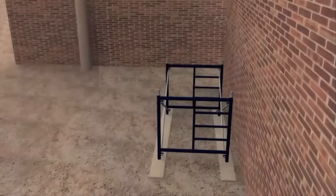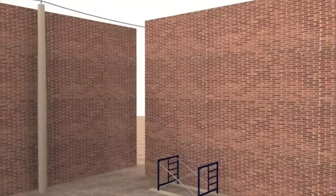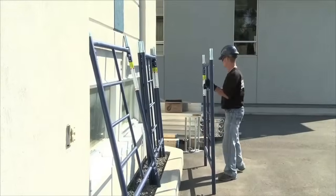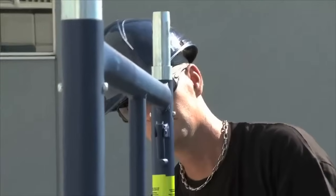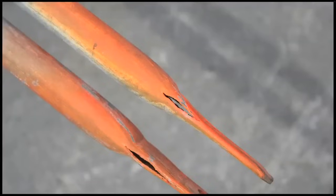You must also think about setting up a large enough safety perimeter so people and workers can get around it. And you must also take into account overhead clearance, especially for electric power lines. For example, the minimum distance can be 10 feet or more according to the voltage and applicable standards. Before setting up the structure, you must always check the parts. You should pay special attention to heavy rust, cracks, or questionable bumps.